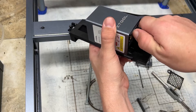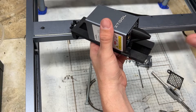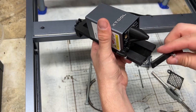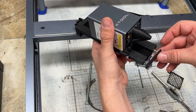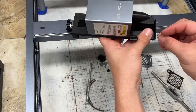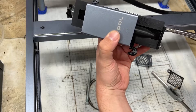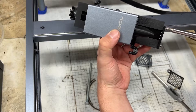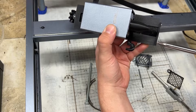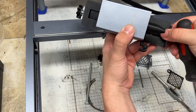As you can see I have this air assist — we will need to turn it a little bit. Then we'll put the base plate back on. The base plate is going to fit on one way, so the holes will match up really only one way, and we'll just put it back on. You want to tighten it where it feels snug but not too tight, because you don't want to crack the plastic. Just tighten it so it's a snug fitting — there shouldn't be any play with this base plate.